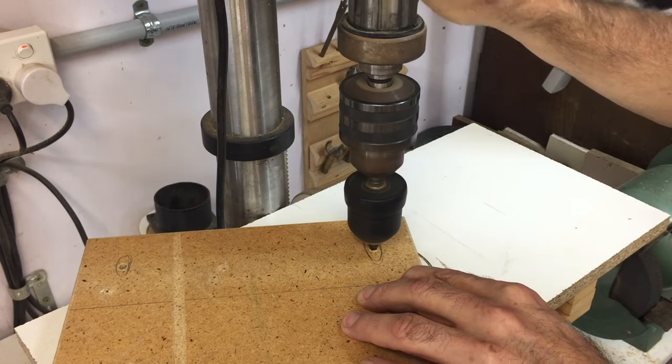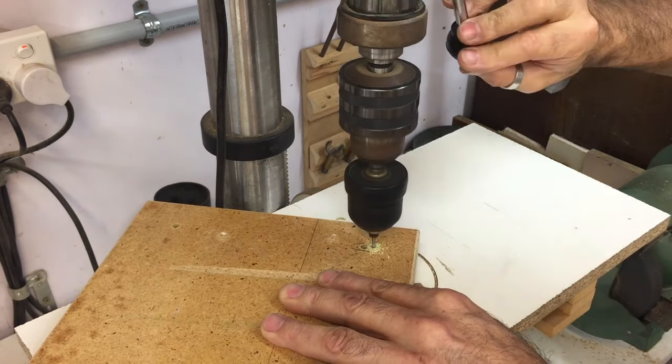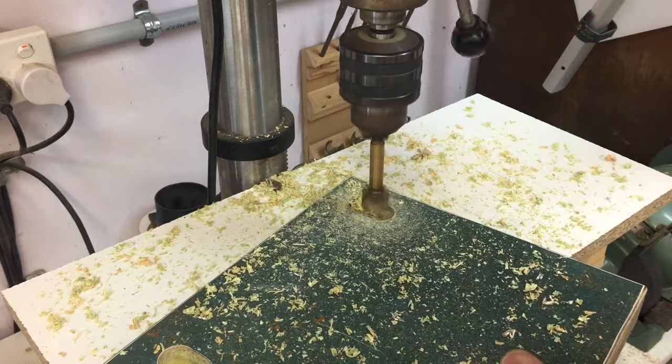Because this board was a lot thicker, I needed to drill the underside with a Forstner bit to set the bolts into the board so that the bolts I had would be long enough. To help line up the Forstner bit, I drilled through with a pilot drill first.